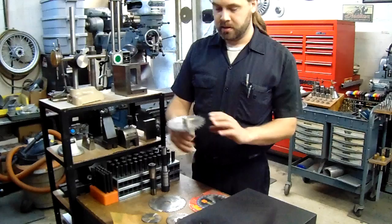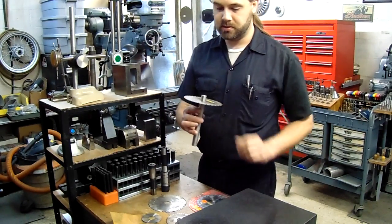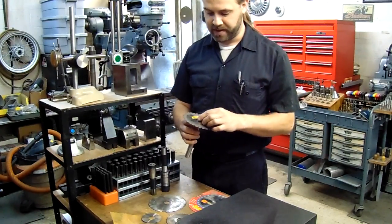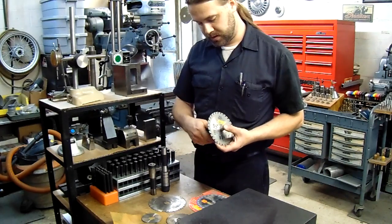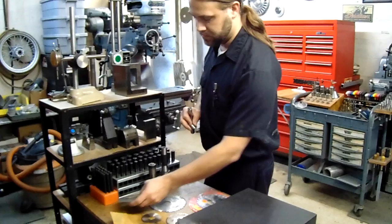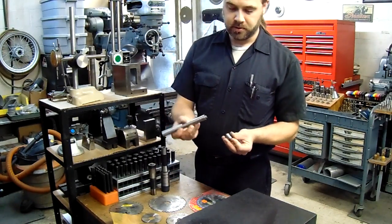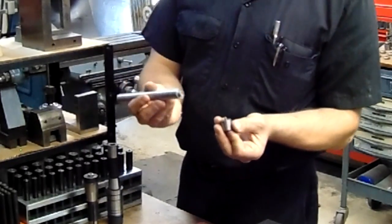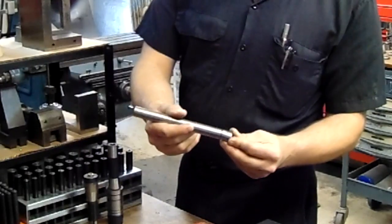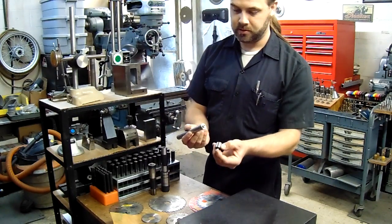But here's my tip: high-speed steel circular saw blade with a carbide tooth. These work great. These are the small ones — this one's a 5 and 3 eighths. These come in different sizes. The key to these is you have to make an arbor for them, because they do have an odd-sized hole — they're not designed for this. I made this arbor. I just laid it down, drilled it, tapped it out, laid this in to accept it. It just goes through, and it's got a socket cap screw on the end that holds it.